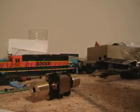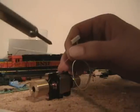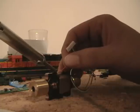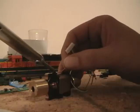According to the diagram, the orange leader wire goes to the top and the grey one goes to the bottom. You always want to heat the surface of whatever you are soldering to get a good connection. Spread that around and try not to move it too much. And we got a good connection — let that cool.